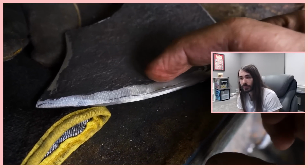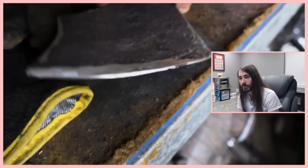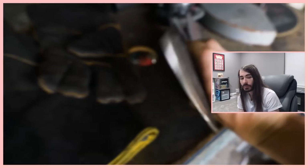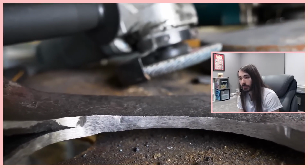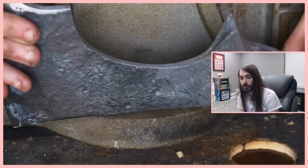So it looks like the file has not properly welded into the rest of the metal, and there are some cracks here. And that's probably because of the incredible amount of oxidation I built up on the axe. But I reckon it's nothing an artisan of welding like me can't fix. Ignoring that, though, the rest of the axe forge welding seemed to work really well, and the two sides stuck together without a visible seam. I don't know what those dwarfs you're talking about. So now I need to decide what to do with the black scale that is covering the axe.